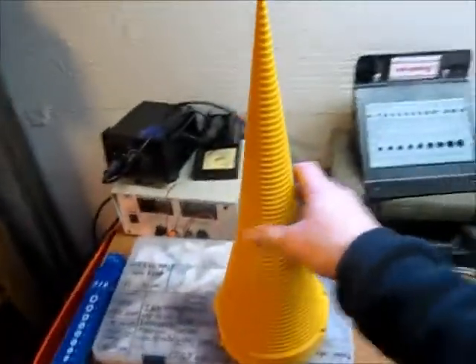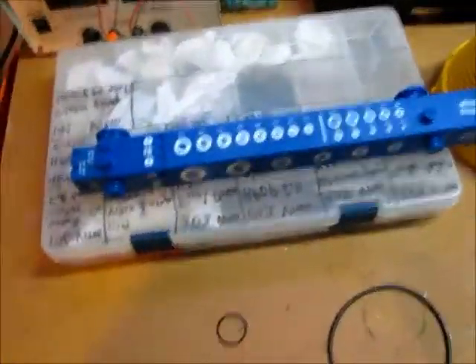This is a pretty accurate, neat little cone — I think it was about 15 bucks if I remember right. There's also this slide rule type thing, which has the same notches in the end that you get the size from. Once you have the size, you put it on the little pegs. This is where the slide rule, in my opinion, kind of lacks — it can stretch like a rubber band. You read the number down here, but you have to know what pressure to put on it, because the numbers move fairly easily. Usually you stretch it fairly tight and that's your number. It's a little less accurate.